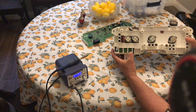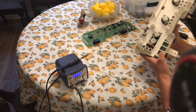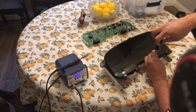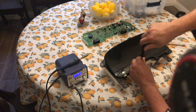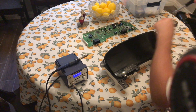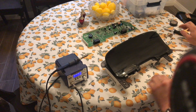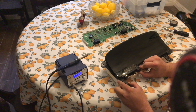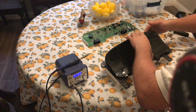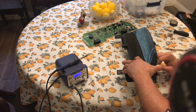The vacuum fluorescent display we're looking at is right down here on the bottom left. I'm going to go ahead and turn the unit over, as I need to expose the front — there are four screws on the front. From here, you can remove the four tabs holding the front of the display on, and then four tabs holding the back of the display cover on.